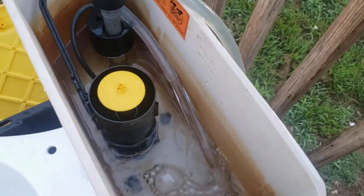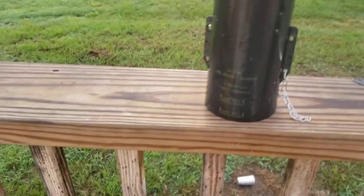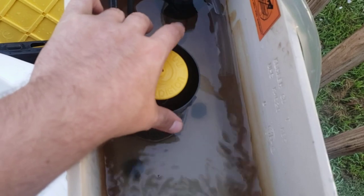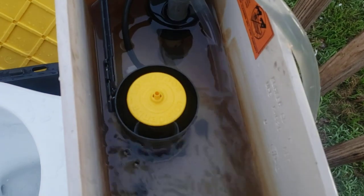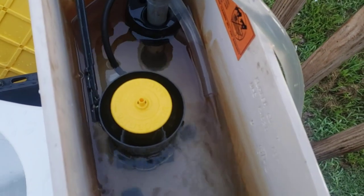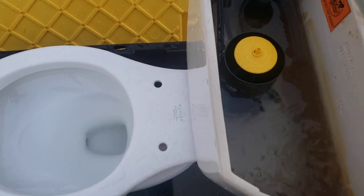All right, I am back and I have the yellow aqua piston installed. I'm going to let it fill up and show you that this one actually does stay up a bit longer compared to the other aqua piston. The main reason I'm even making this video is because I know a lot of people have the big three-inch flush valve Wellworth and Highlines that you can't easily swap a three-inch flapper into. I've done it and if you do it just right it'll work, but often you can have a bit of a pain getting it to seal, so installing one of these that stays open longer could be a bit of a save for people wanting a longer flush.